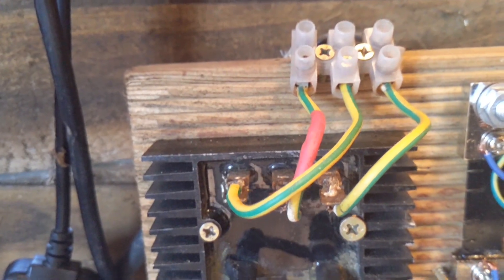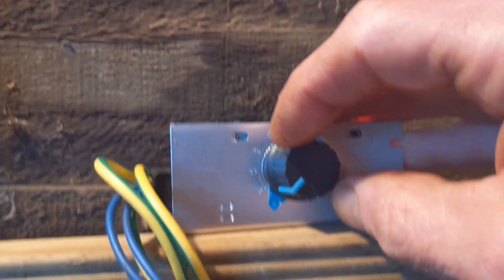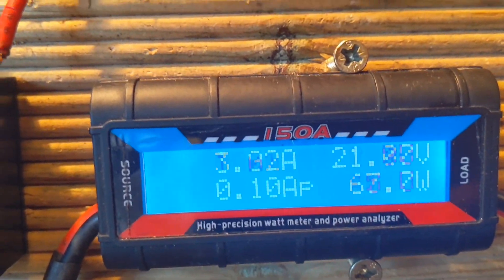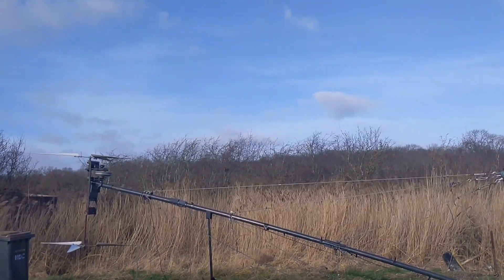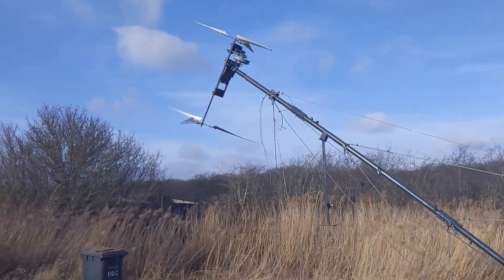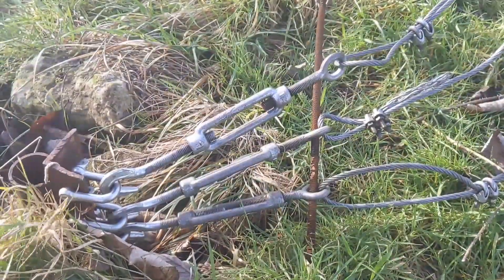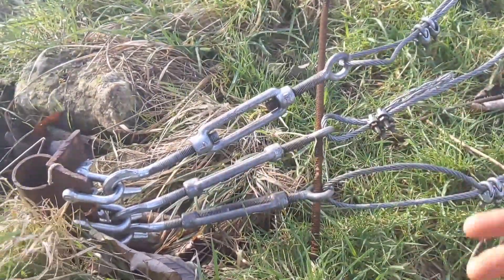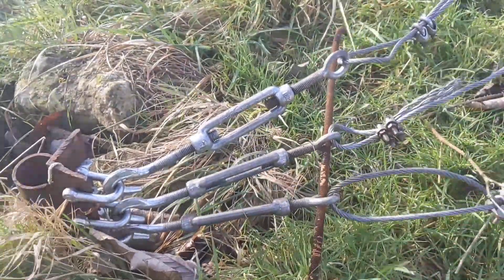But I prefer running it off this bad boy. We're just going to see — when I turn the speed controller knob up, we shall see the power start to go to the dump load. Right, I think it's time to put the tower up. I'm going to get on that winch. If the wind blew the camera over... I have to make some slack on the left hand side otherwise the tower tightens up too much, so I just need to tighten these to get this cable a bit tighter.